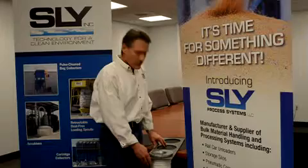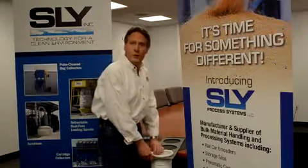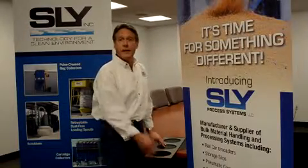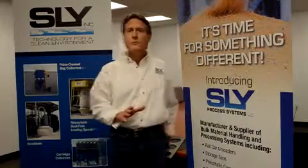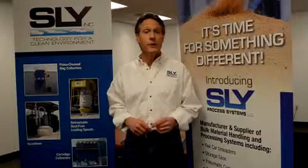Removal of the bag requires taking out the cage, deforming the snap band with your hand, or simply kicking it in, and allow the dirty filter bags to fall into the hopper. Be sure to remove these bags through the hopper access door before installing new filter bags and restarting your collector.